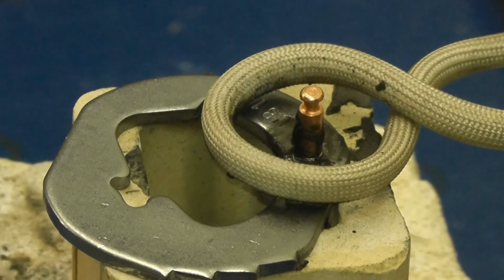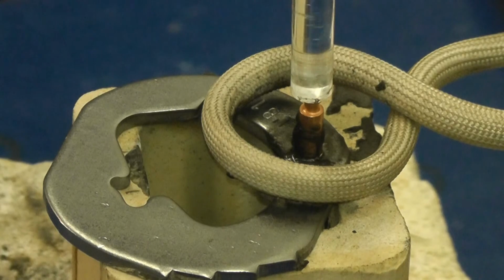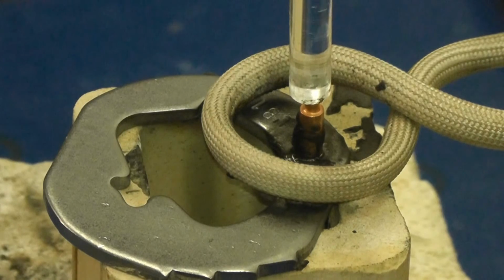Okay, with this set of tests, we now have a silver braze ring mounted at the bottom of the braze joint. We're going to continue running at 3 kilowatts of power. And the purpose of using the braze ring is to allow us to braze at a little bit lower temperatures, actually much lower temperatures. And after the braze tests are done, we'll be sending the parts to the customer to do pull tests to see if they have the strength required in the part.